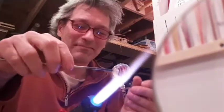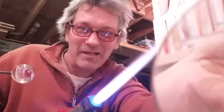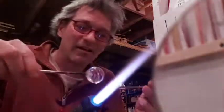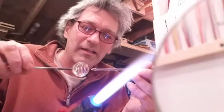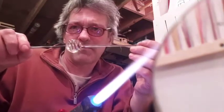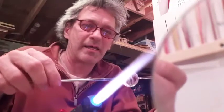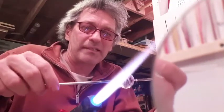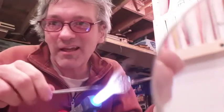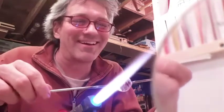All right, so now my last attachment point is going to be glass. I made a pencil point of my glass rod. I'm going to get the surface of the glass a little bit warmer, and when they're the right temperature, touch them together. Now I can heat my last steel punty rod. Pull it out of the surface of that glass. All right, I'm there. That's the last little dimple.